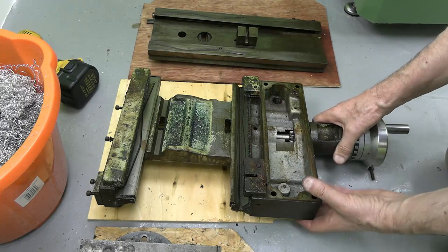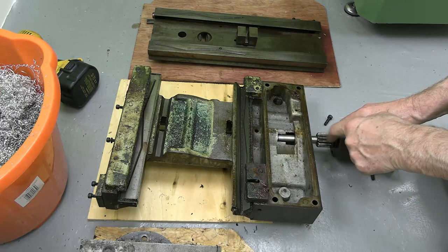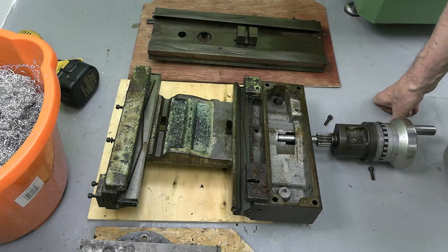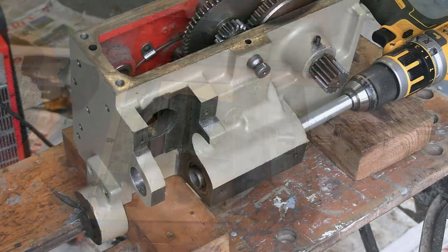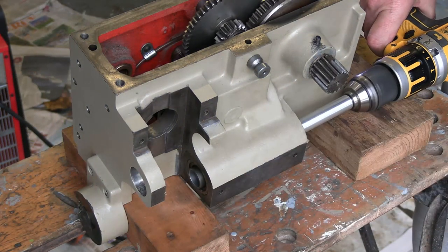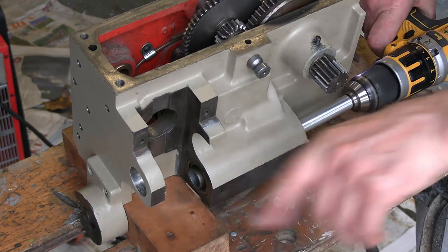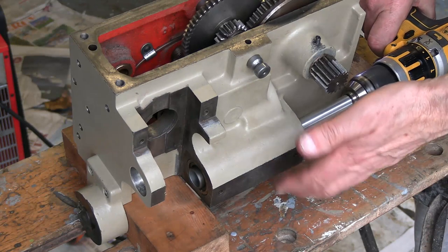Although I think it would be better if slightly more of the teeth on this gear - the width of the teeth - were actually engageable under power feed. But that's how they designed it. And finally we have this assemblage here, which the slotted shaft slides in and which trans-couples the drive to the apron.